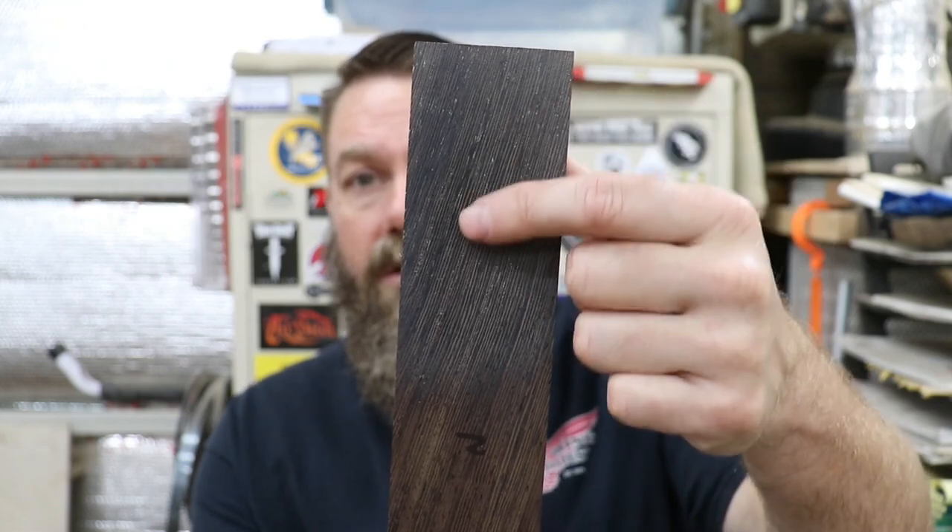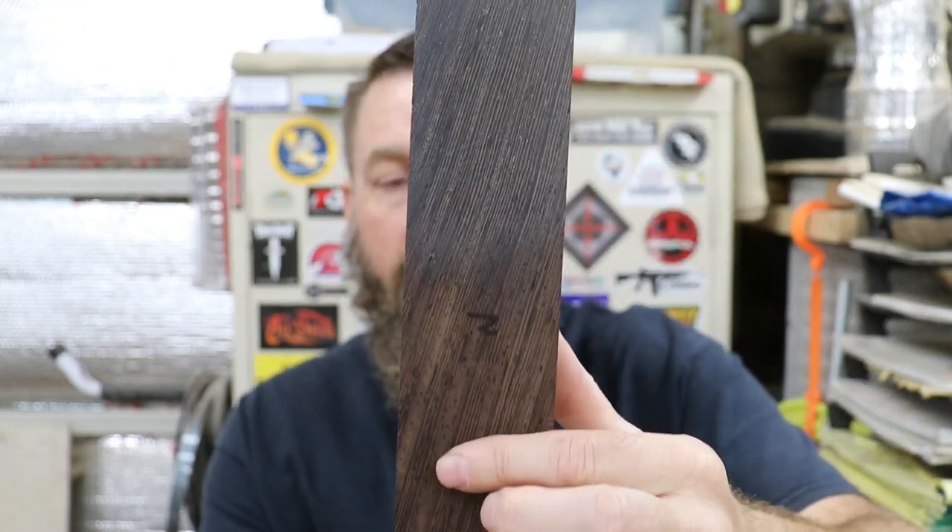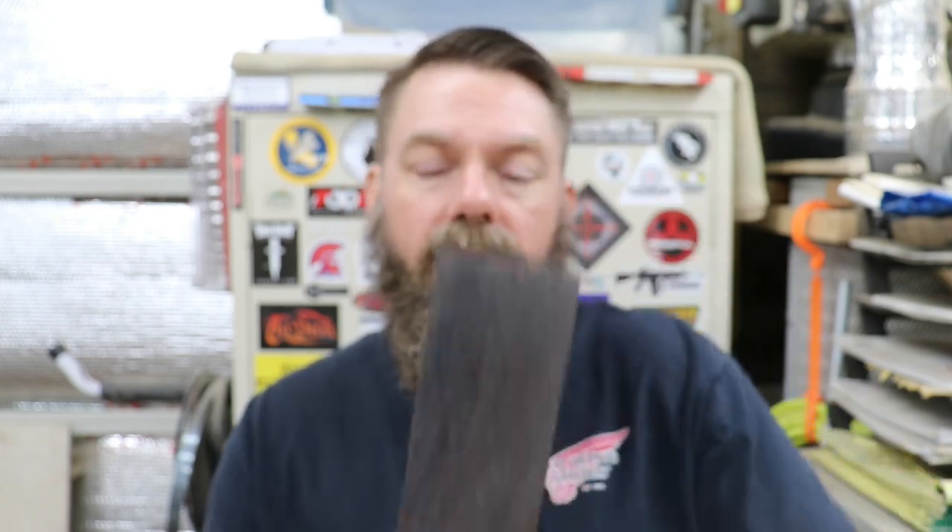I got that in the clamps and went out to run some errands. I stopped by my local hardwood dealer and bought Rubio Monocoat in the color natural. I tested it on a scrap piece of wenge and it didn't really look that natural — you could see where the Rubio was versus the bare wood. So I took it back and exchanged it for the color pure, which should just be clear. Rubio shouldn't really add any color or tint to the wood, which is what I'm looking for. I've never used it before, but a lot of people really like it. It's a little pricey, but from what I've seen it goes a long way — you don't need a whole lot, so that kind of offsets the cost.